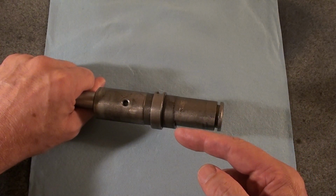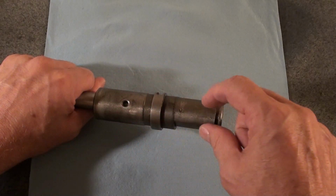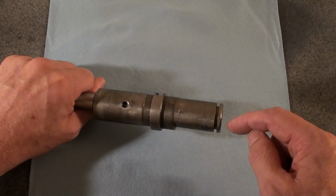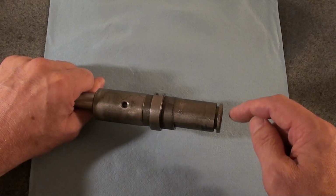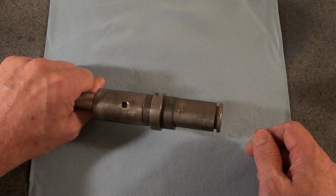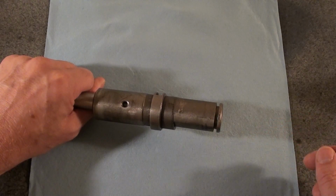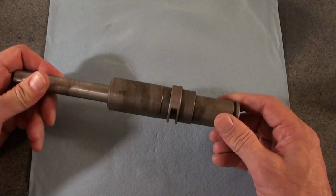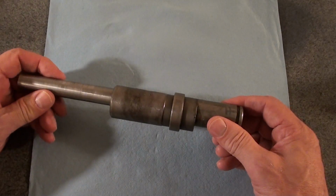and dial it in. I'm going to modify this mandrel so that there's a smaller section that'll go all the way through the hole, and then I can dial in the small diameter on the end. That's the thinking so far. I would love to have a better way to do it, but that's all I've thought of so far. Let's see.